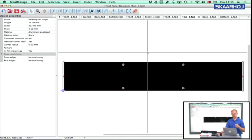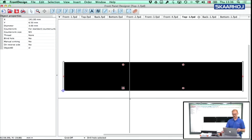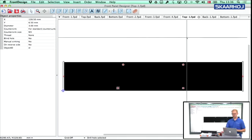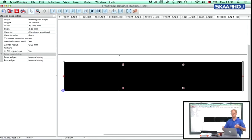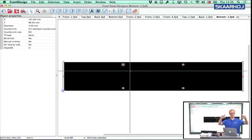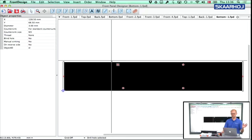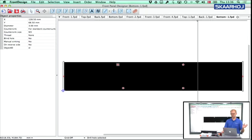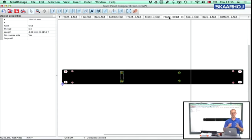So if I take the top panel, I can decide, because there's no orientation on this one. So I take this hole, 1, 2, 3, 4, 5. On the bottom panel, it's now the top, because the bottom panel will be under like that, 1, 2, 3, 4, 5. So now I have moved the hole for the housing bracket 25 millimeters to the left on the bottom panel, the top panel, and on the front to accommodate whatever I need to accommodate, like my ideal position of elements on that side.